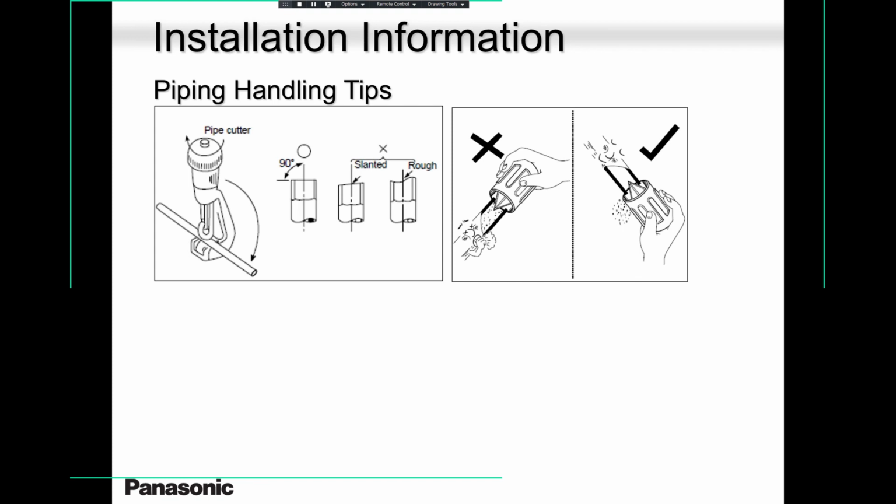Just last week, I had a problem on a multi-zone. The guy called me and said, Paul, out of these two units, one unit is dumping a lot of heat, but the other unit is not working fine. And he's telling me his piping is perfect. I'm not at a job site, I'm talking with him on the phone. It was this past Saturday. So I told him, well, if you're telling me your pipe is good, then pump down the system, disconnect that unit that you think is bad, and connect it to another zone. Instead of using zone A, use zone C. But before you do that, just do me a favor and flush the pipes and see if your pipes are good enough. He calls me and says, Paul, the pipe sounds good enough, but there is a little bit of a restriction.